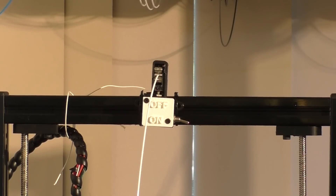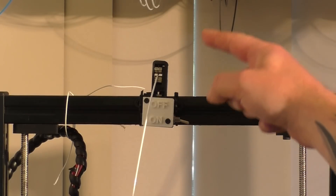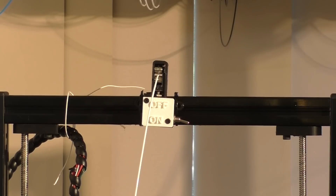You can see that I've got that connected to the top of my printer here, and the filament's just feeding in through there, through these little bearings, and then down to my print nozzle. So basically when you get to the end of your roll, it's just going to pull through nothing, and then as soon as those two contacts touch, it's going to set off the siren.